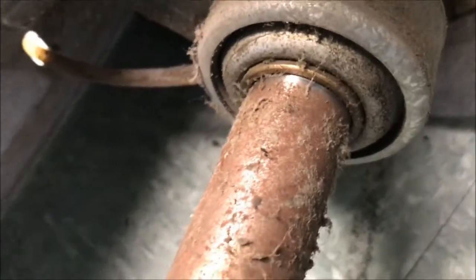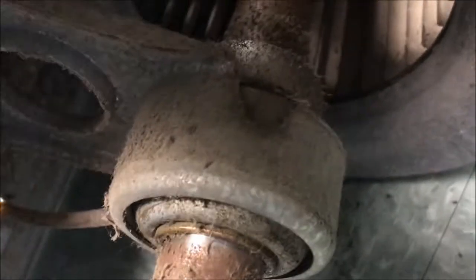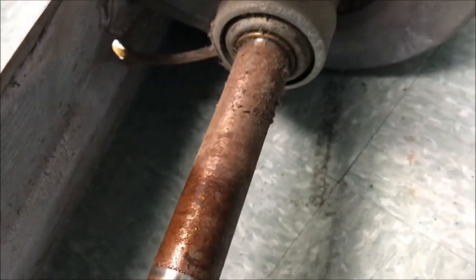So now I'm going to give it a little wipe down, then I'm going to spray it with some penetrating oil, and then I'm going to sand it down and clean it off. And this guy here ought to slide right off. I got the bearing off — got it all nice and clean. Bearing slid right off.